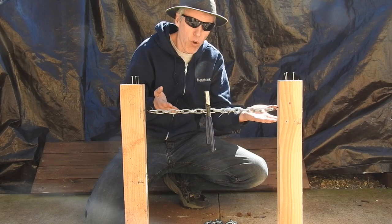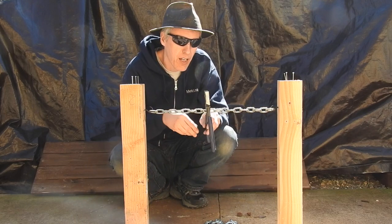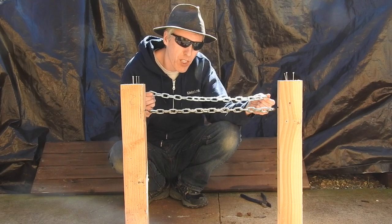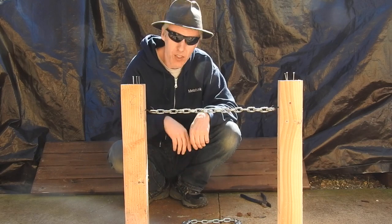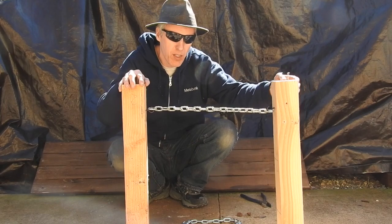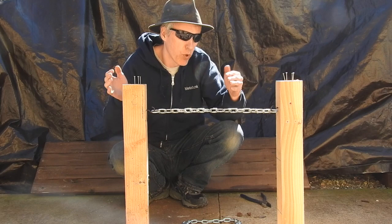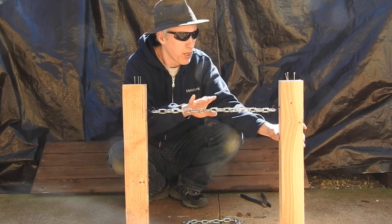But say this floor truss, this beam or whatever, was to lose its structural integrity and start to sag — that's going to be represented by this. This is a very extreme example; it's lost all of its integrity. It demonstrates the principle of what happens when something is sagging and it's attached to something that was previously stiff. To say this is the core of the building and this is the outside — any exterior loads get transmitted through the floor because it's stiff, so this will resist being pushed in from the side. Any displacement of this column will be resisted by the floors, as well as the floors holding up what is underneath them.